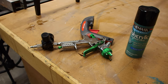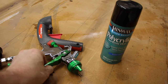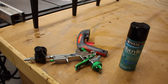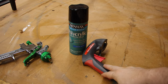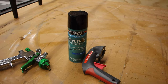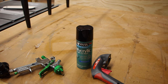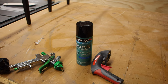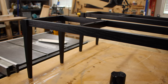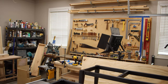The spray gun I used is a cheap one off Amazon — about $40 with tax. It comes with a regulator and a 2.5 millimeter tip so you can spray latex paint, gel coat, or primer. I'm spraying polycrylic with it using a little plastic handle. Here's a tip to make your projects look more professional: use a matte finish. Finishes that are too glossy look plasticky and cheap, but a matte finish looks more like professional high-end furniture. I'll put several coats on the base — at least three or four — sand lightly before the last coat, and still need to put an oil-based finish on the top.